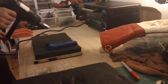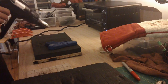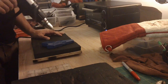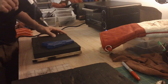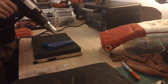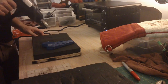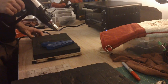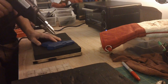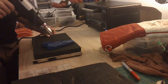I was able to really push this the other day. The slower you heat it, the higher you can get the temperature, it seems, before it reacts negatively. So if you have all day, you can probably push this up to 300 some degrees. I think the Kydex literature talks about how the heat deflection is at 300 something degrees, and I don't necessarily know if heat deflection refers to when it combusts or starts to evaporate, or starts to change state somehow, or smoke or burn. But apparently you can get this to a pretty high temperature before you really see it break down.